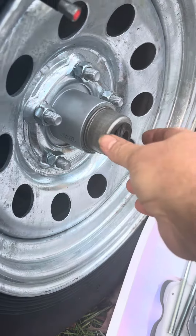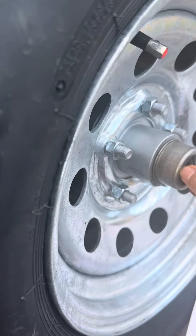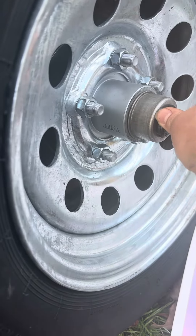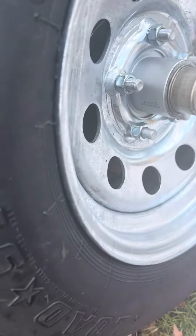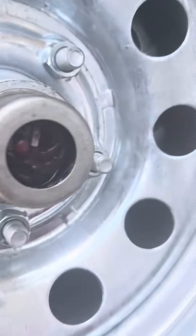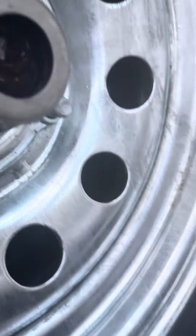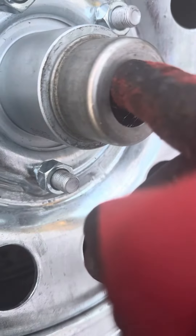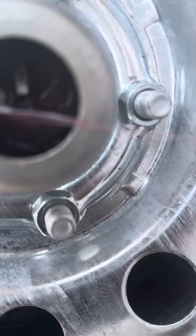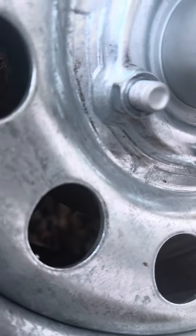Anyway, to get to your grease fitting — and I use the manufacturer-recommended method on this particular trailer — you basically just stick your fingernail in there, or a small screwdriver, and pull this cap out. Then hopefully you can see in there. You're just going to look for the small grease fitting; it is up top right there. It's not focusing well, but anyway.